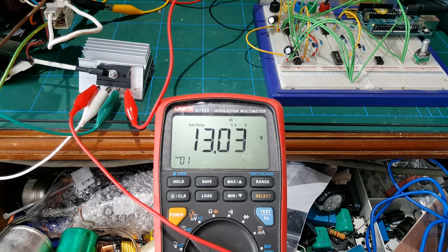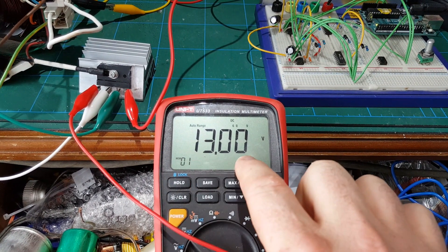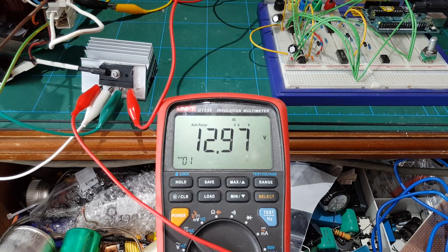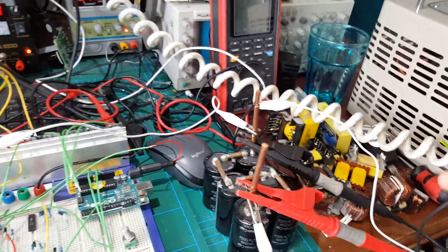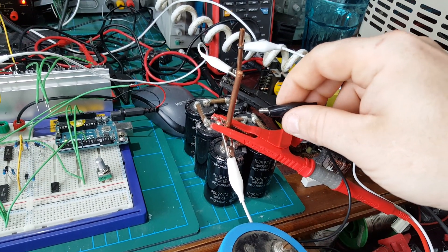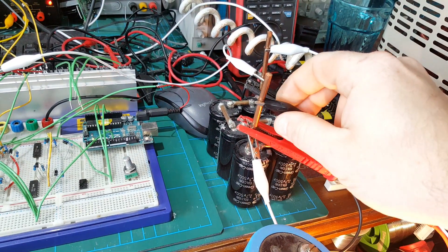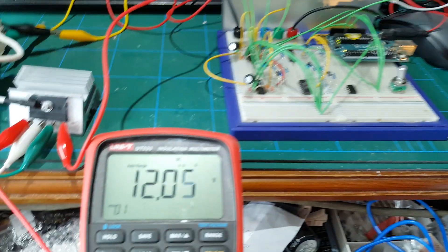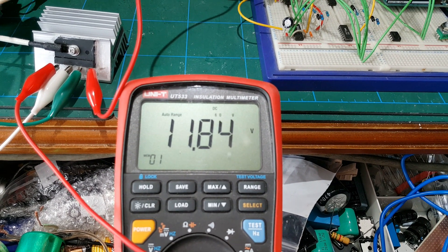Super capacitors are brilliant for this. Now you've got the problem — your power's stuck in your supercap bank, and the voltage is too low to pump back into the battery pack. Now comes your buck-boost converter, which will step it up to a high enough voltage to charge into your battery bank. That was five minutes of charge and we've captured pretty much all of that. Our little light bulb is simply going to emulate being the buck-boost converter, pumping the power back into the battery. It's a 21 watt bulb.